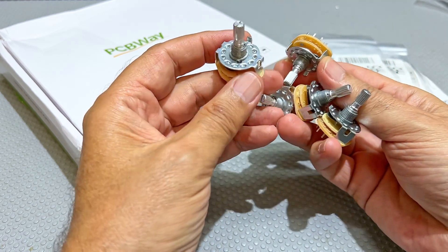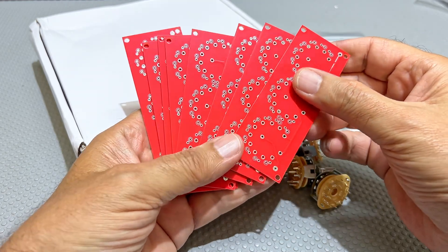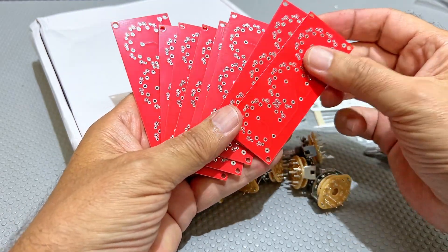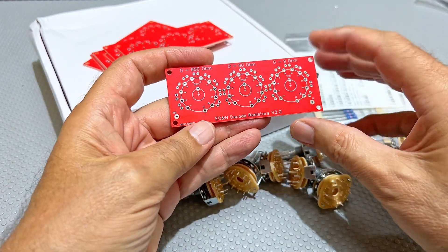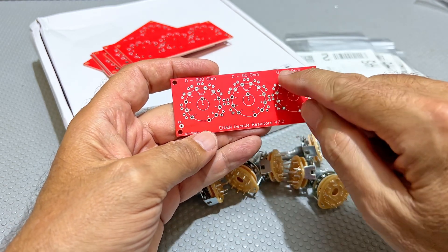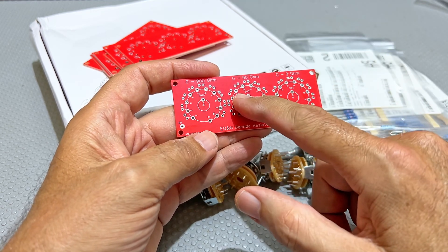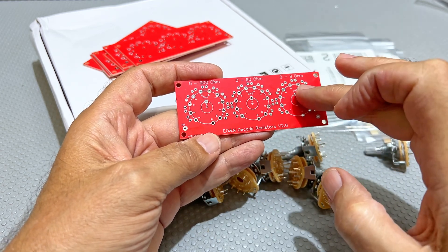I'm going to put a link in the description below if you want to get some yourself. I then went ahead and designed and ordered the boards, and I've done them in modules of three. I've got 10 boards and I've used one already for that small one. The reason I did these smaller — they're all identical — is because I wanted to make this in groups of three so I can use, for example, one for 1 ohm, 10 ohm, 100 ohm. In the final version I'm sharing on PCBWay's website I've removed the ohm labeling so it covers 1 to 9, 10 to 90, and 100 to 900 — and it can be ohms, K, or meg.